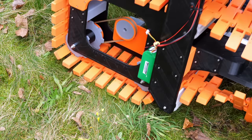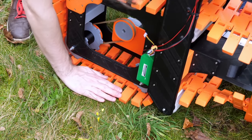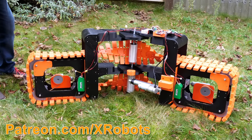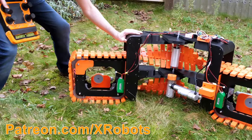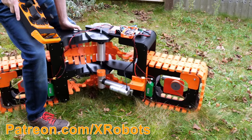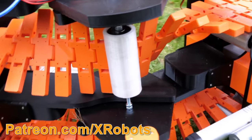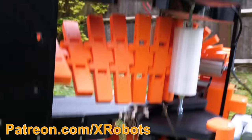What I probably should have done is had some really wide dolly wheels on the sides there at the bottom, so they actually hold the track and brace it down on each side. I'm pretty happy the mechanism works otherwise. I thought driving with it bent would be helpful because it's propped up in the corner and then it wouldn't rock so much, but all that happens is the belt skips until I lift that corner off the ground. I think what's happening is that the belt's getting stuck where it twists and the track tries to twist and untwist in the bottom at the middle, and that's getting stuck on the grass as well as probably some lumps tipping it over in that direction even more. So that's a real problem and I think we can't really do much about this — on a smooth surface we don't have the issue because it doesn't get stuck in the grass.